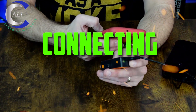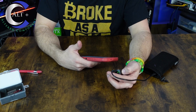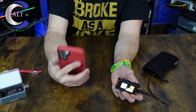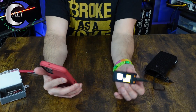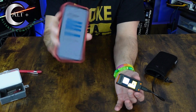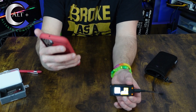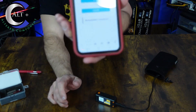We got our device, we got our phone, we're going to scan the QR code. This has the QR code right on the front — it says the Wi-Fi SSID is 'Jingle Miner' and the password is 'Jingle Mining.' You should be able to scan the QR code and it pops up with the Wi-Fi settings. But no matter how I went through my Wi-Fi settings, I could not get the configure screen to pop up. So it's a good thing this happened to me — if it happens to anyone else, you'll be able to figure it out. If you've connected with your phone but the configure screen doesn't appear, make sure you're still connected to the device in your Wi-Fi settings, then open an internet browser and go to 192.168.4.1 — that will open the configure settings.